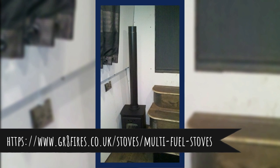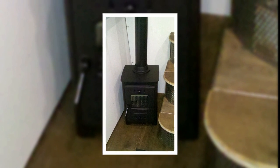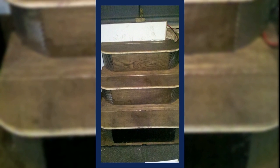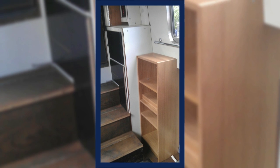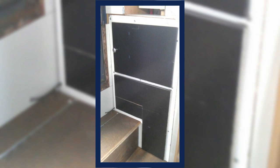An afterthought was a wood burner, or multi-fuel burner. We had some purpose-built steps made to get in from the cruiser stern, which meant there wasn't a lot of room for the wood burner. I adapted the right hand side of the steps to move them over and give a little bit more room. I made a metal stand which I tiled, which allowed space under the log burner as a wood store and gave a bit more room away from the side of the boat and the steps for safety reasons.